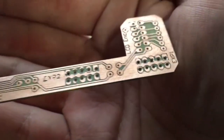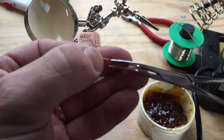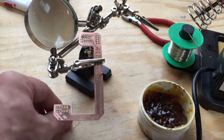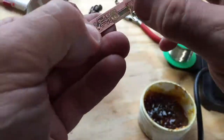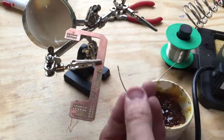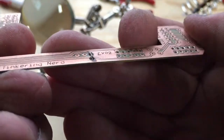After everything is drilled, I put a little chamfer on the holes on the side that won't be soldered. We'll start populating the board with vias first. The main reason for creating this board myself was the simplicity — it doesn't require through-hole conductive vias hidden under components, so everything is just minimalistic, just what it needs to work. It looks good enough for us to continue.